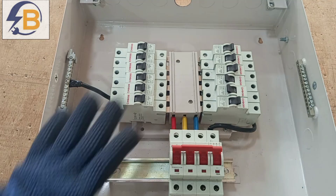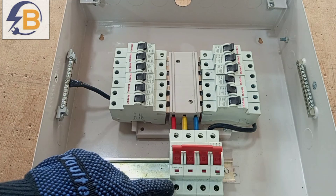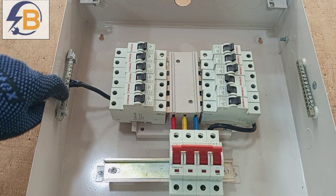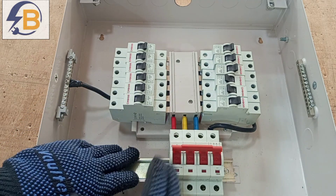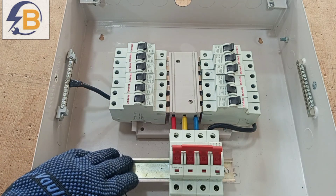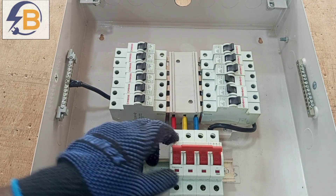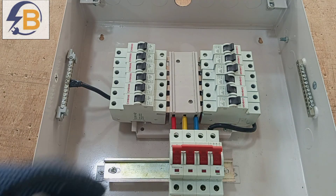For instance, this is a three-phase consumer unit, and it usually comes with a four-pole main breaker — so we have four poles. That is connected to the miniature circuit breakers and the neutral bar, which is used for the neutral connections. For protection against shock and electrical fires from leakages, we need to include an RCD in this consumer unit. Usually, the DIN rail on which the main breaker is fixed is extended to accommodate at least one RCD.